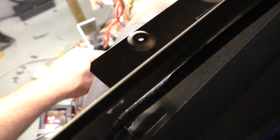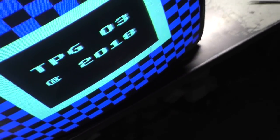that's the image we want. See how it's got a triple image? Now with this triple image, I need to adjust the frequency pot, and I'll bet you we can get this to lock in here. Oh, nope. Man, let's leave it right there and adjust this one now on the remote pot. Hey, there we go.